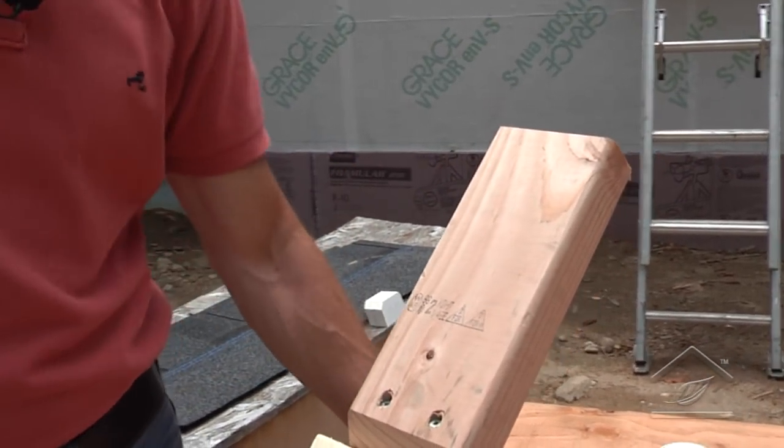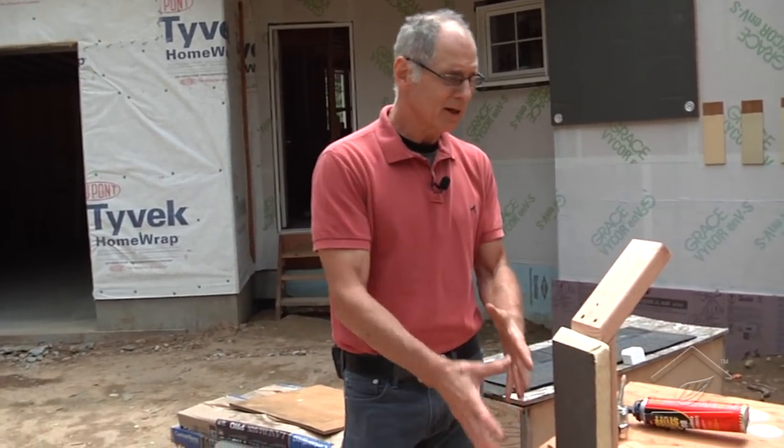Strong attachment is critical on the back because we're going to put solar PV panels on top and we're worried about uplift. We're doing solar thermal on the back of the garage, which is more conventionally framed. We really wanted to focus on a system that local labor could execute — frame with local guys — and then super-insulate the outside.